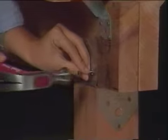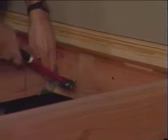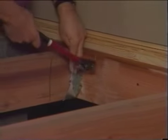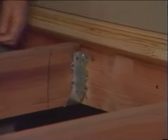Avian and I have used framing connectors in many of the projects on the Do-It-Yourself show. In building a deck, we use these post caps to stabilize the beam that supports the floor joists. Also in deck construction, as well as many building projects, joist hangers are ideal for supporting joists. They're easy to install, and again, they eliminate toe nailing altogether.